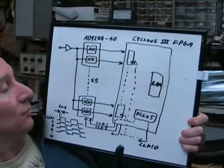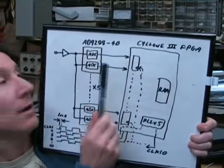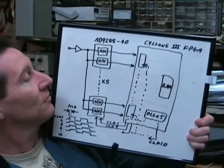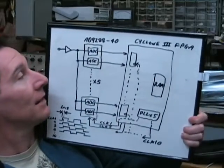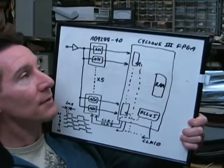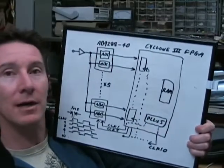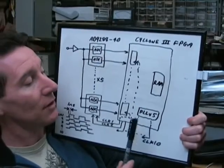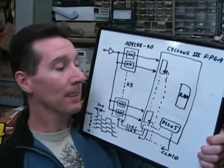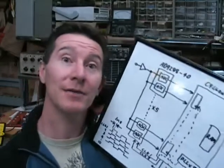I've pre-prepared a diagram of how I believe it's working inside. What they've got is five AD9288-40 chips running at 100 megahertz. Inside each one is a dual ADC — two separate ADCs with their own clocks. These are clearly going into a Cyclone 3 FPGA right next to them. It's a low-cost, bottom-of-the-range FPGA, but it's got five internal phase-locked loops — five PLLs — which can actually be set with phase outputs in increments of 98 picoseconds.